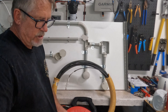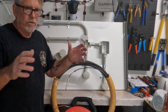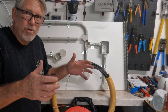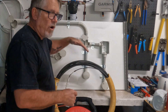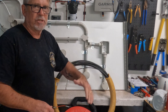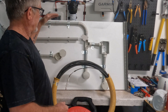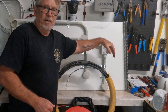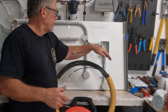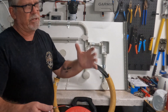Typically in the electrical industry, electronics industry, and cabling industries, there are a few ways we can do it. As we're setting up our conduits, we can put what we call a draw wire, draw rope, or pull rope through the conduit system itself — especially on the big runs. We put a string, wire, or rope through the conduits and have it come out the other end. Then we tie our cable to it and pull it through. Nice and easy.